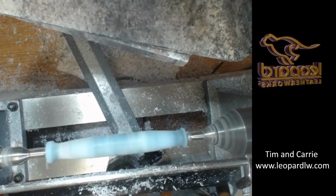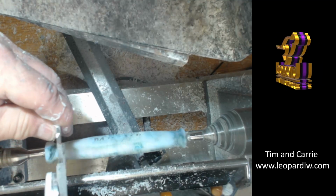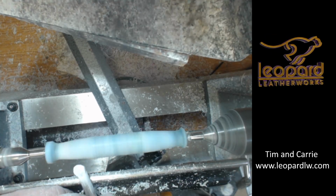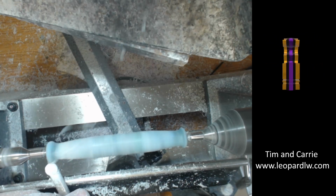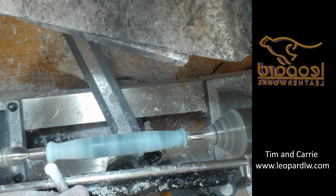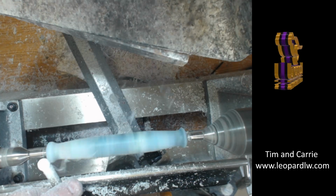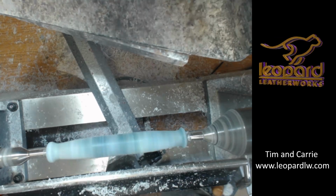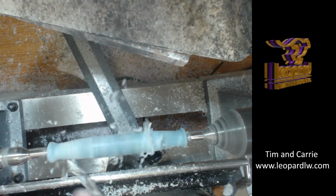All right, we should be near the finish line on this side here. It is 0.5, oops, lost it already. 0.58. So we're getting down there, very nice. Let's go ahead and make this an end first, and we'll clean it up and push it down towards the end. Again, I leave it a little fat in case I have a problem, and I can either always skinny it up or move it down, one or the other. That's nice and round. Let's clean up the dome. Beautiful.